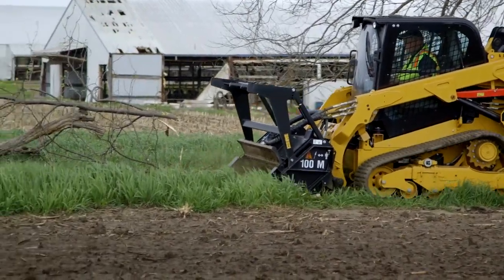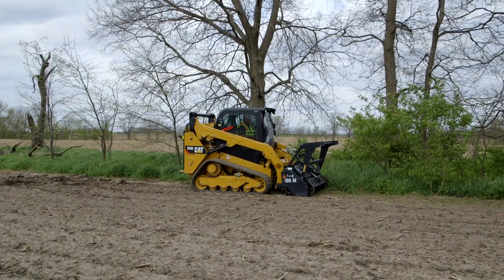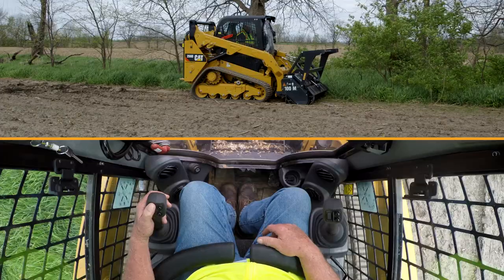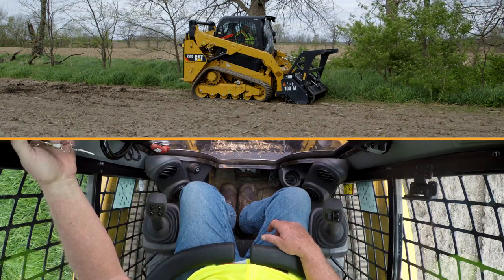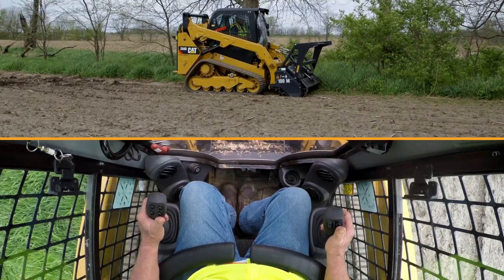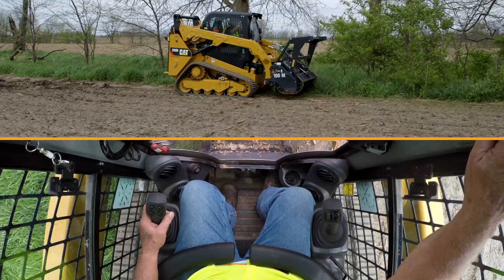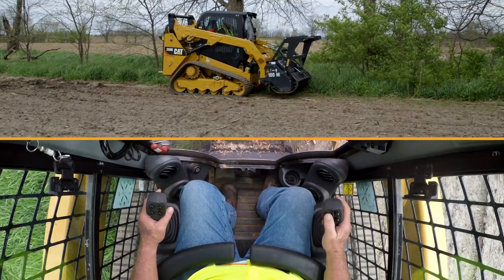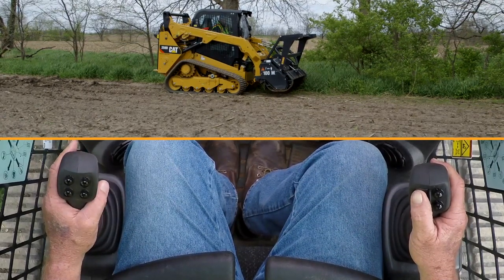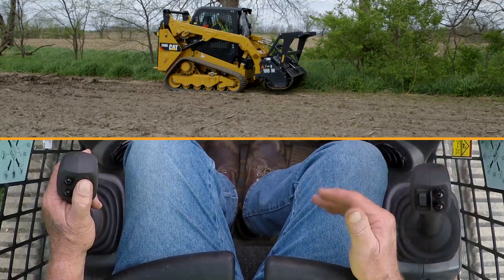All the material is returned for ecology — just to waste away naturally. We're going to talk about the HM 115 on how to operate it. Starting up now: we'll need continuous flow. During startup, blow the horn, go to the ignition, start the machine, activate continuous flow, raise the machine a little off the ground, release the parking brake, idle up about halfway, and activate the mulcher by pushing the A-B roller switch up.